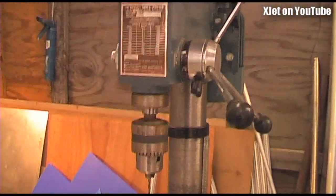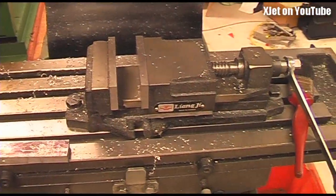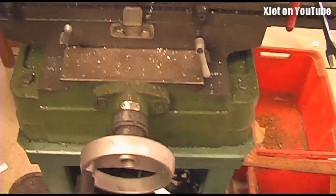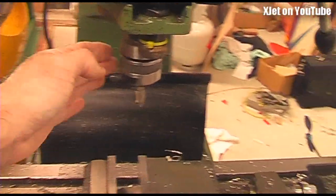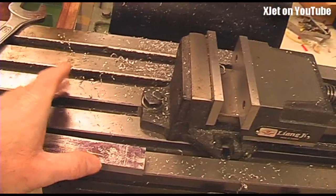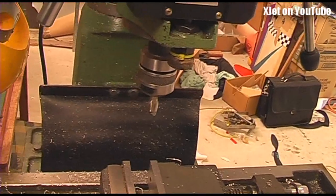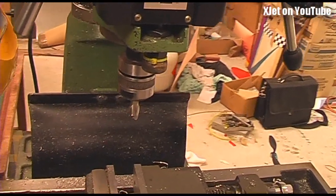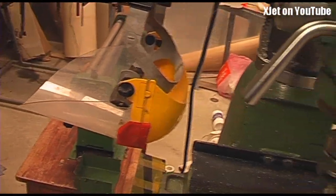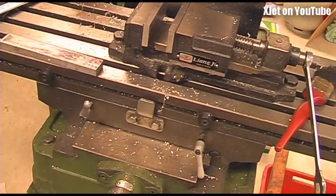This of course is a drill press — everyone has seen a drill press; we use this for drilling holes. This is my milling machine — it's a manual milling machine, no computer stuff on here. It has a milling chuck in which you put various milling cutters, a nice strong milling vise, and sometimes we clamp stuff to the table. This is used to mill slots where we want air to travel through for the front plate on the valved engines, and to mill the valve grids when necessary. It's one of the key pieces of machinery in my workshop — I use this an awful lot.